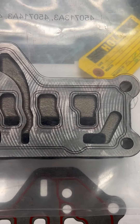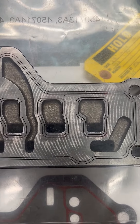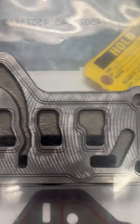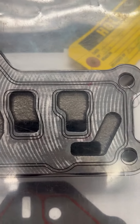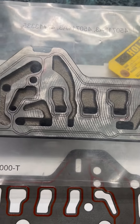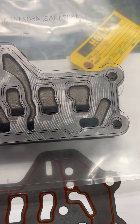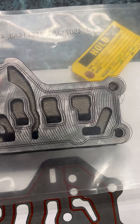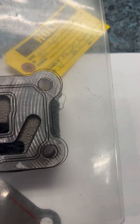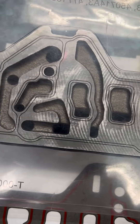This is an acceptable part. If I were to move this to what we have seen previously, you will see that the lines do fall within the cavity — that would be an indication of a failure. In this case, where we had it lined up as shown, it is correct to the gasket and lands on the machined face, creating a solid seal around every cavity pocket and perimeter.